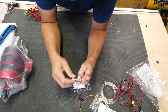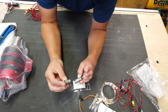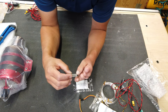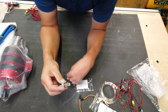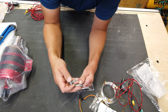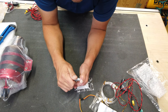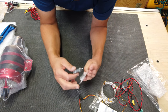If your filter happens to not have an arrow or you're using an older Kingtech, basically the fuel, you can see there, always goes from the outside of the bucket to the inside of the bucket. So if you think about the fuel filter as a bucket, because it's got that same shape, it goes from the outside of the bucket into the bucket. That's the way I always remember it. But nice looking filter. It looks like they've also upsized it a little bit as well too, which is nice. So anyways, that's cool to see.